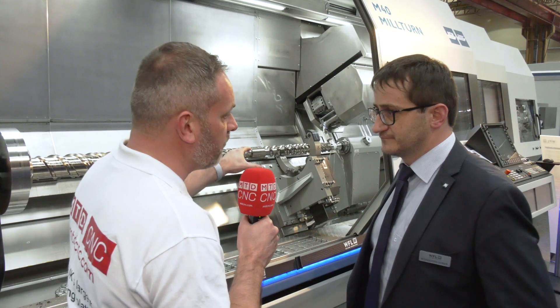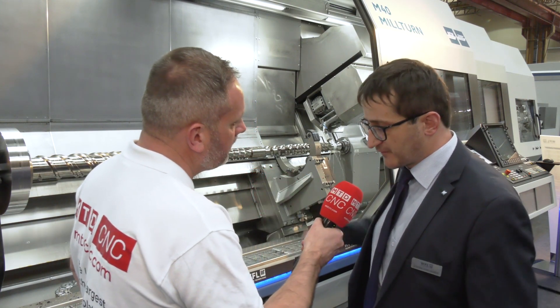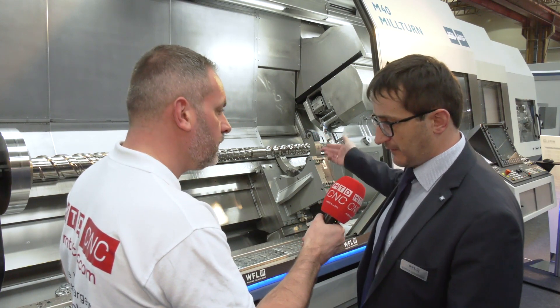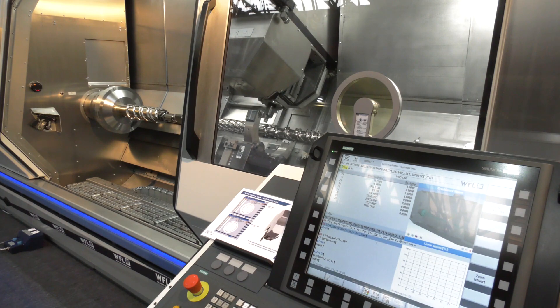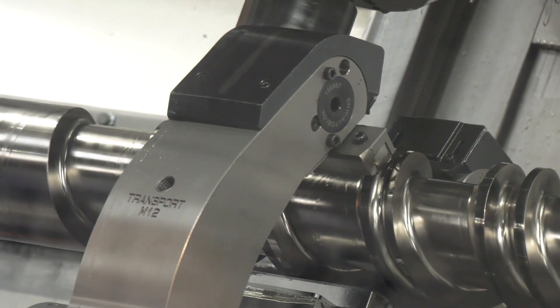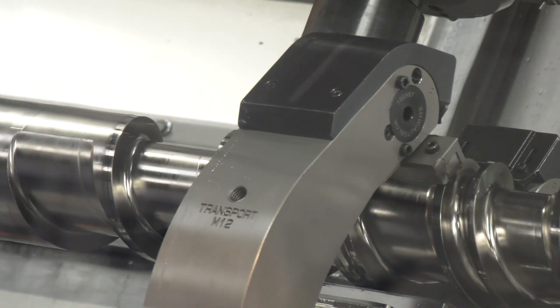You have a steady here rather than rollers — what are the benefits? As you can see, the screw is already machined, and as the screw is already on, we cannot use any roller anymore. This is why we have to use such guide pads. During the milling operation, the steady rest is moving along the machining point to give us the maximum rigidity during the milling process.